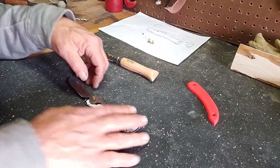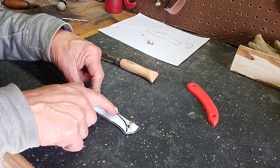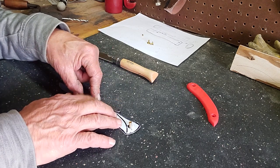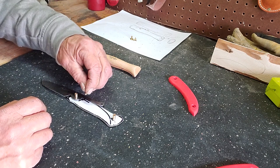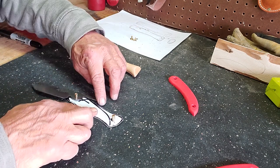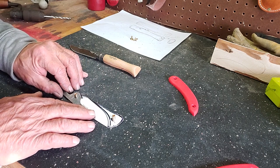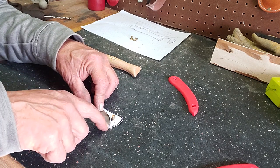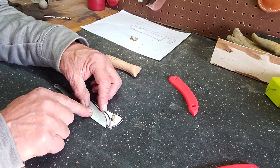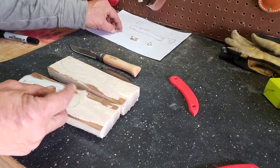When the blade is open, I need it to sit so that this piece is sticking out slightly — it kind of follows the edge of the handle at the top, but this must stick out, and there's a reason for that. Now I have the correct position for open. If I close it, that means the pin — this guy that stops it from going any further — goes there. When I close it, it's going to hit that pin. Is it going to hit the blade? It's going to stop right there — I'm not going to hit the pin, there's quite a distance between there. Plus the tip is under the handle, which is important. So now I have my template. I can draw this out on my blocks of wood, drill the holes, and start shaping.